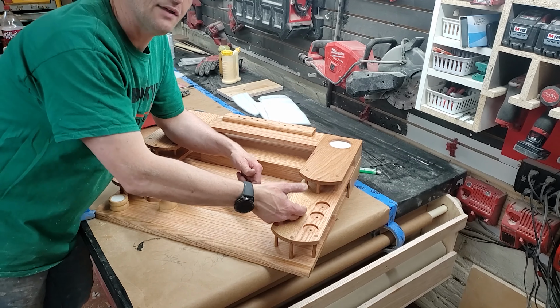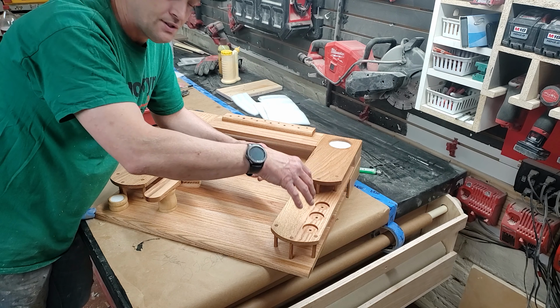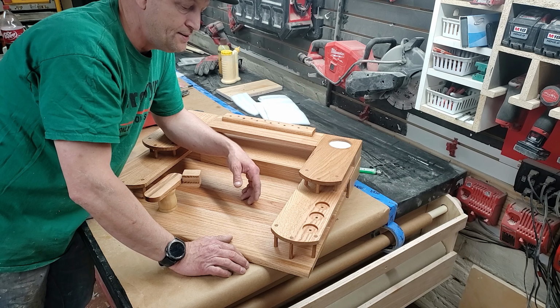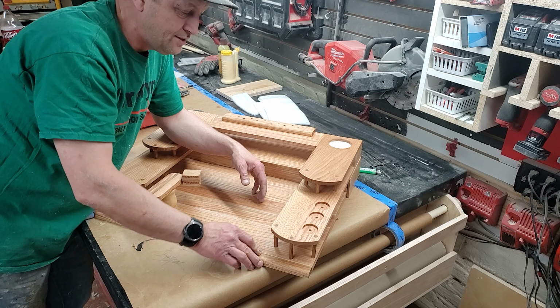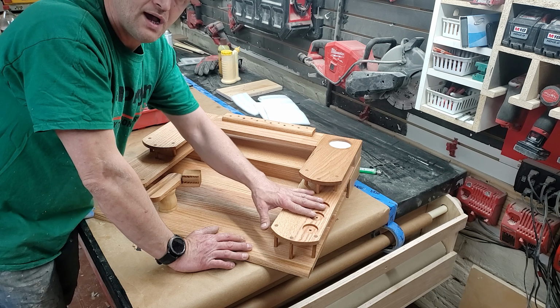So first I tried to do it by hand with a screw gun, but the problem was that I couldn't distribute the pressure 100% right like a drill press can. So then I went ahead and made just an extension on the drill press, clamping it anywhere I could, just so I could get these holes exactly 1/4 inch deep and make them all identical.